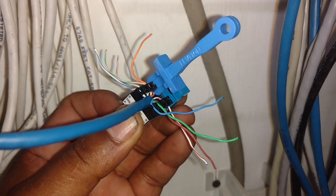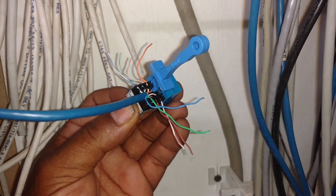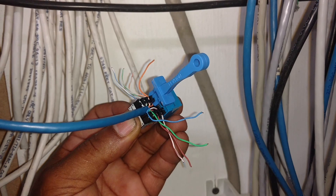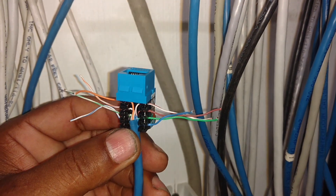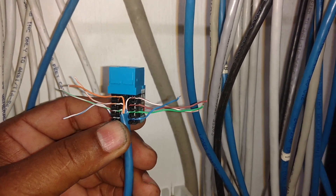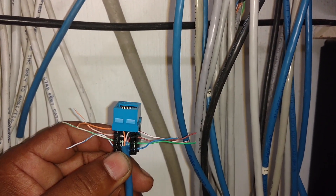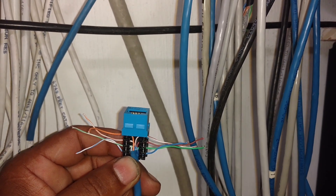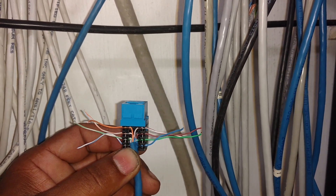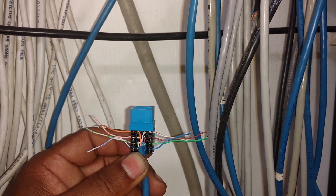Set it on a hard surface, push it down till it gets all the way in there, and do all eight of them. You just have to make sure that you get these colors in the right slots, because there is no margin of error for having the wrong wire hooked up to the wrong connection. After they are all pushed down in there, you are good to go as long as you have no broken wire somewhere else. Remember that all eight of these wires may not be used in whatever system you are hooking up — it may use five of these wires or four of them.